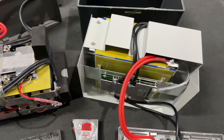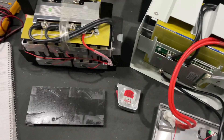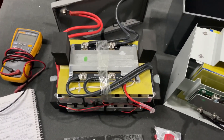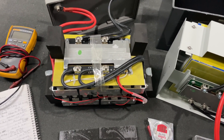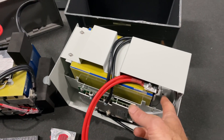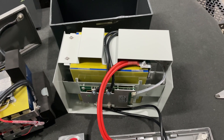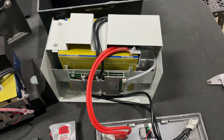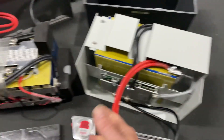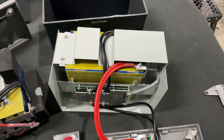When I first did the review on these Vultix batteries, a lot of people were saying they're used cells. I don't believe they're used cells at all. From what I can find, there are manufacturers that supply failed or B-grade cells to the market that don't meet the A-grade standard. These cells have test tags on them showing around 106 amp hours, which could mean they were failed cells that didn't meet the required standard — maybe they're meant to reach 110 amp hours. Date tags on the plus battery are all within about six months of age.